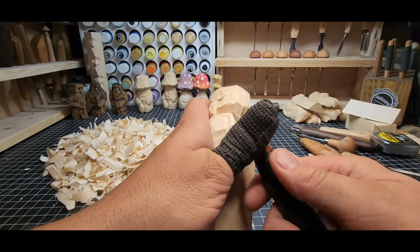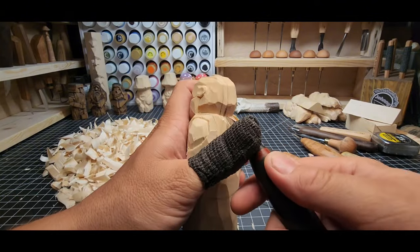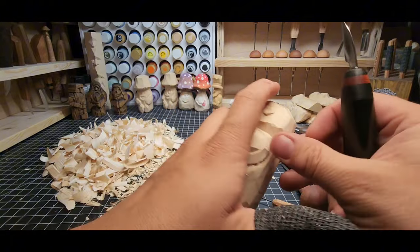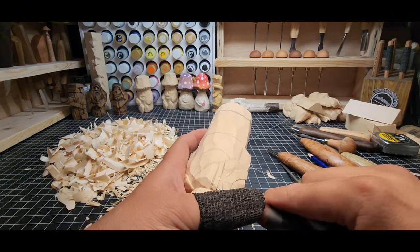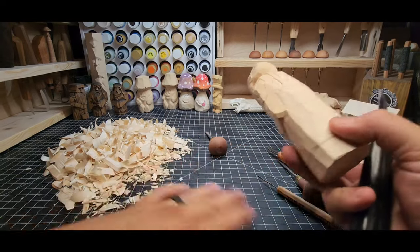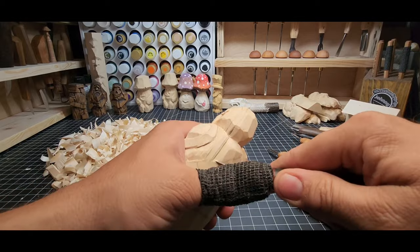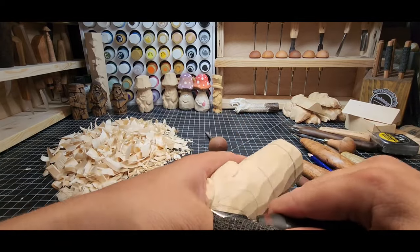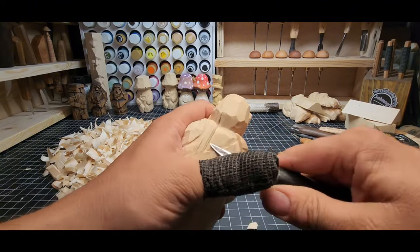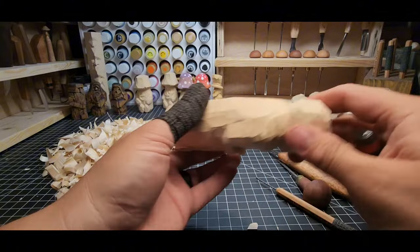Some folks use the carving glove as a crutch to keep themselves from getting hurt and just carve a little bit too wildly, whereas if you don't have a glove you might be far more careful. That's my philosophy — be more careful from the beginning. We'll do the same thing here in the back of the head and back of the neck with that red line coming up from the back, barely taking a little bit of wood out all the way down to where this tunic top is going to be. The tunic top as well we can define a little bit more deeply than the red line, because that red line is supposed to be paint on skin and this is cloth on his back.